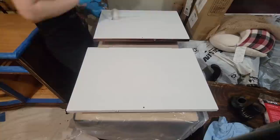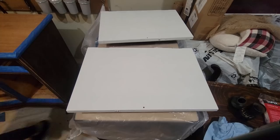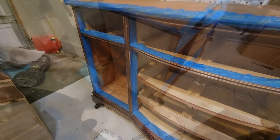If you're worried your doors might stick, you can label your hinges. Even when I do that I still have trouble, so you don't want to paint the bottom of your doors or drawers if they're really tight — you can also just extra sand around the edges. That way, when you're adding like five coats of something — your paint, your primer, your top coat — it really adds up. So if you give it an extra good sand, you're less likely to have your doors stick when you put them back on.